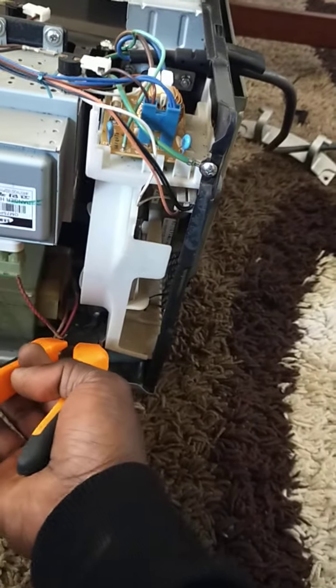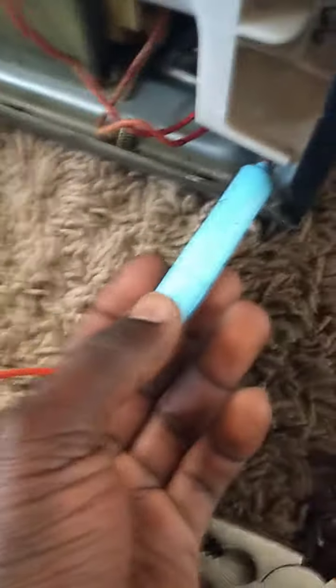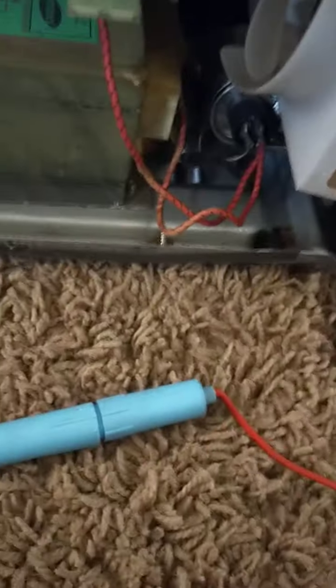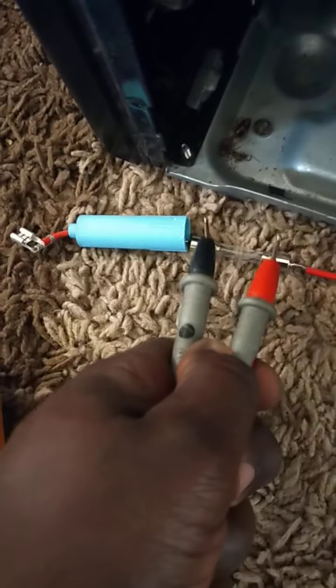Once you neutralize the power, remove the fuse. We check if the fuse is okay — you can easily open this for easy work. We remove all the terminals. This is the fuse, so we test it. We test the fuse and get nothing — no continuity.